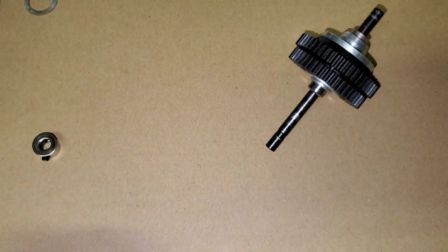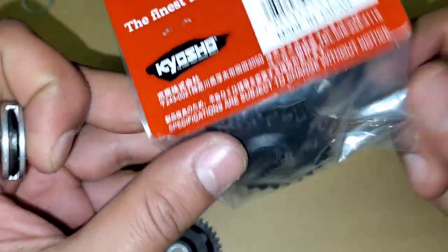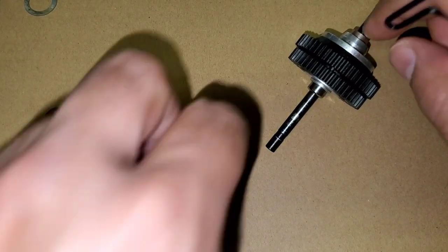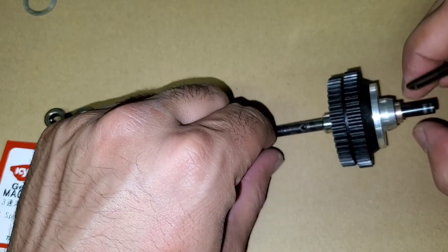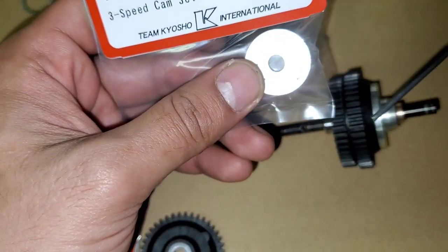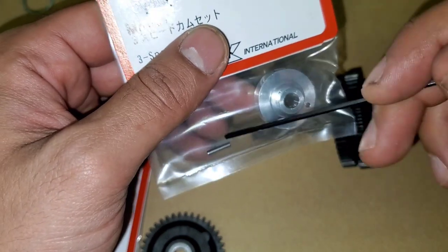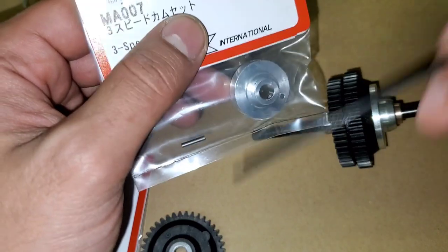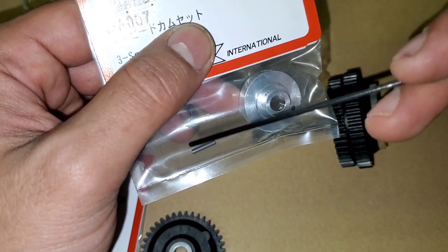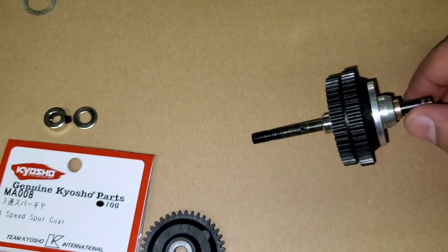We're going to have to remove the bearing as well if possible. I did pick up some extra bearings in case I damage them while removing. It looks like we've already got a collar on the new ones. So that's number two repair. We just need to get that pin — I ordered this whole cam, there's the pin. I'm going to use the old cam first with just the new pin, in case I screw up the setup, and then change to the new cam after.